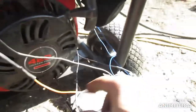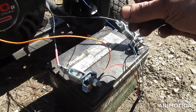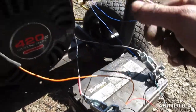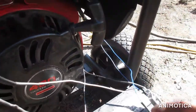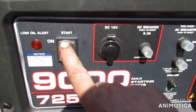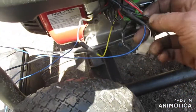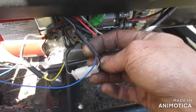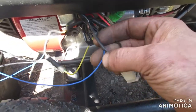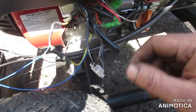I've got my power wires going to my battery, and then the relay is closing the ground circuit — the ground side of the wire. In my generator I've got a two-wire solenoid, and when you hit the switch that closes the ground circuit of the solenoid. I tapped into the ground side of the switch, and when my relay closes it completes the ground circuit to the solenoid and the solenoid will fire.